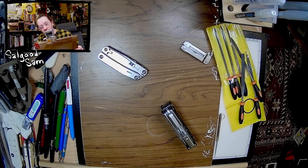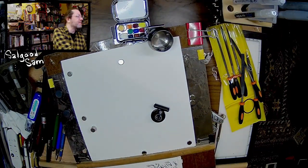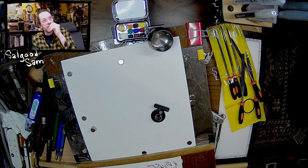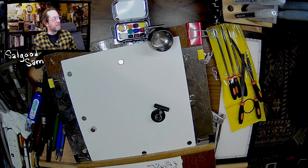I found myself some 430 stainless steel. I actually ordered some smaller pieces at first — I didn't realize that stainless steel wasn't all magnetic. I have some sheets of 300-series stainless and nothing sticks to it. There's a weak interaction — you can kind of feel when the magnets are near it, but it doesn't hold. So I did a little reading and realized I got the wrong kind.